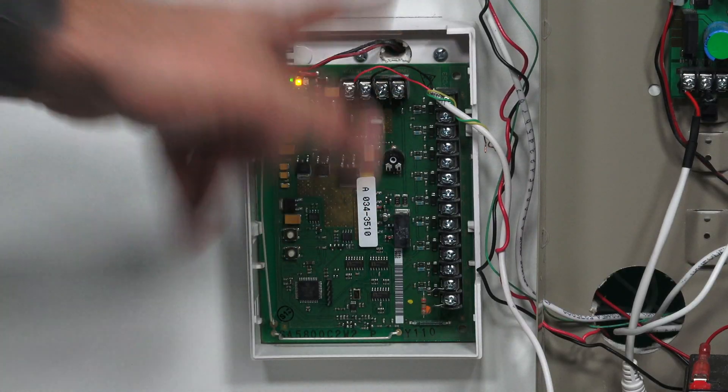It also has a DC power input — it gets 15.5 volts DC from its provided transformer that comes in the box when you order it. It also has a power output that you can use to power some devices, though it doesn't provide a lot of power, so it's not really recommended to be used as a main power source for DC power devices.